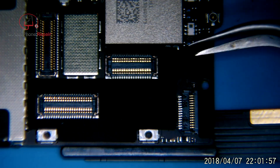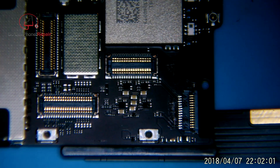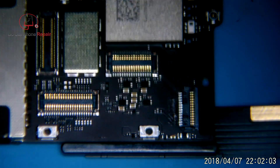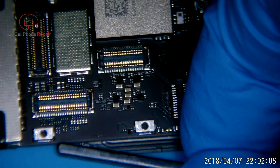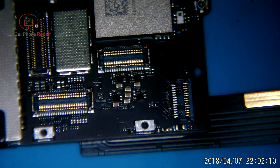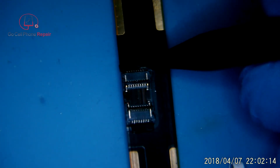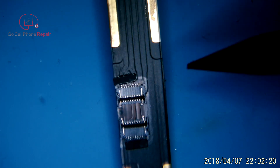Make sure that you peel off this tape on the opposite side, and there's a little plastic piece here that sits on top of the cable. I would recommend you remove that as well, as it is not going to tolerate much in the way of heat. I also like to take these little plastic things off of the cable and transfer them over to my replacement part immediately.